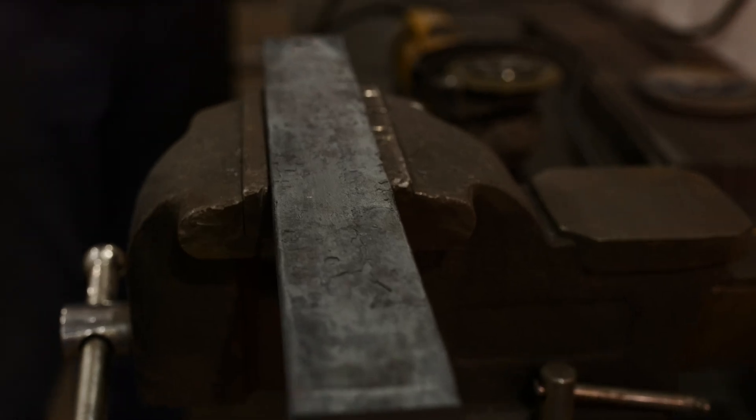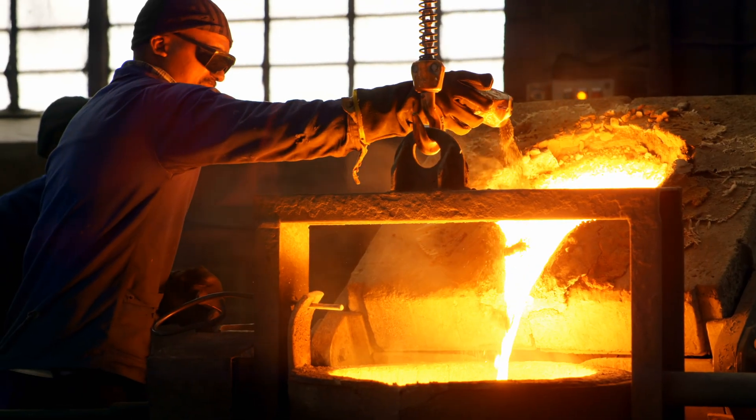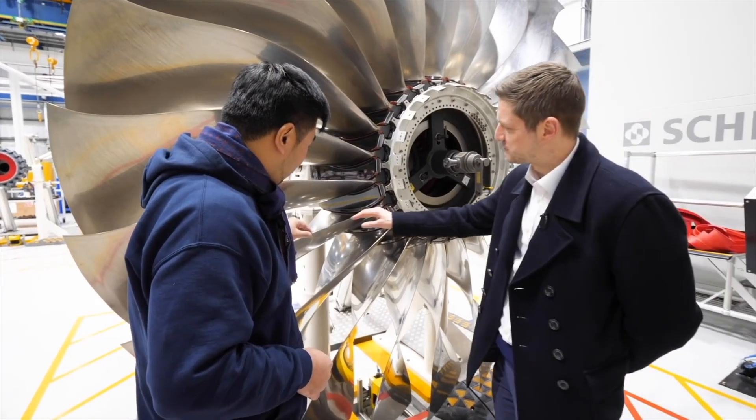It's not particularly complementary when it comes to steel. With cast iron, it tends to refine the grain. I remember one of my old university lecturers telling me that when he worked in a foundry, they were casting engine blocks for Rolls-Royce, because the old Chieftain tank used to have a Rolls-Royce diesel engine in it. They used to put a bit of copper in to refine the grain because, Rolls-Royce being Rolls-Royce, their cast iron had to be a bit better than everybody else's. He didn't reckon it did much benefit, but it was Rolls-Royce, so we all had a good laugh about that.